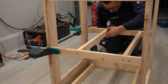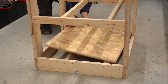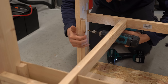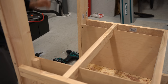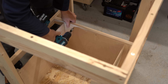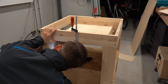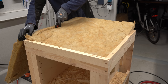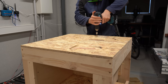Next I put in some reinforcement beams for the middle and lower sections and used those to install the lower OSB floor. At this point I also scrapped my initial building plans and went freestyle to somehow mount plywood to create the inner walls for the batteries — my new bandsaw was a huge help here. After the lower section was done I moved on to the middle and upper section, repeating all the same steps. With all inner walls complete it was time to cut the mineral wool to size, push it into the cavities, and close everything up on the outside with OSB.